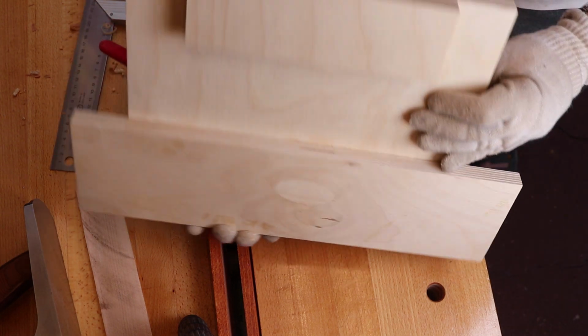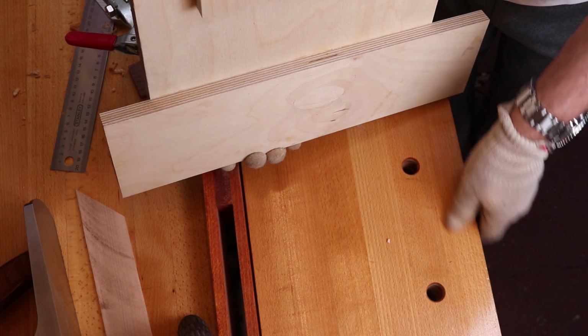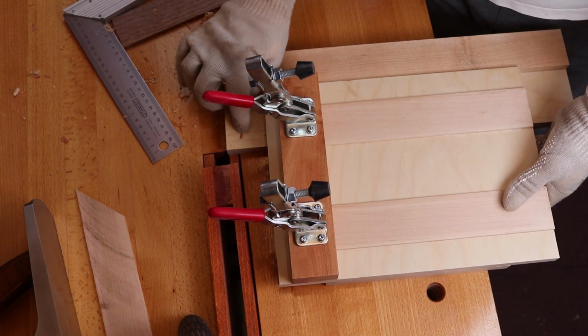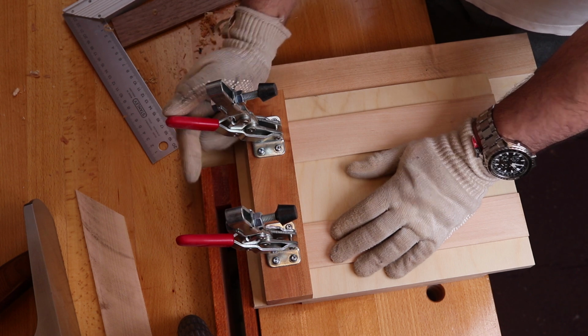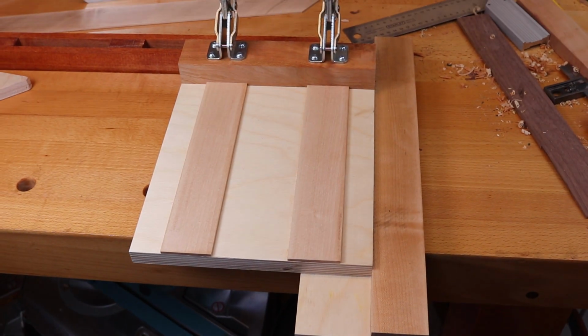To attach your shooting board to your workbench, you can add a back hook at the end of the board. Or, if your workbench is a split top type, you can use this to your advantage as your shooting board stop. Also, the extended bed will help prevent the shooting board from moving to the left when you are using it.